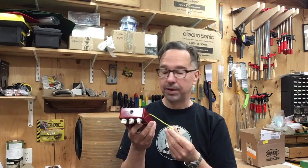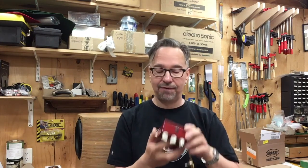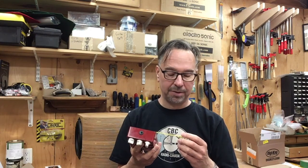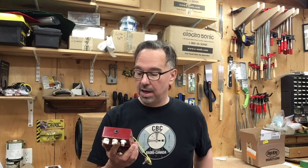So that actually went fairly well. Given the potentiometer, I could increase the gain of the clean side of the effects pedal and then adjust that with the level of the affected side. Ended up with an overall boost. I measured the combined impedance of the resistor and the potentiometer, and it ended up being around 27K. So if I wanted to, I could pop that 47K resistor out of there, replace it with a 27K, and then I'd have an overall boost that would last essentially forever.